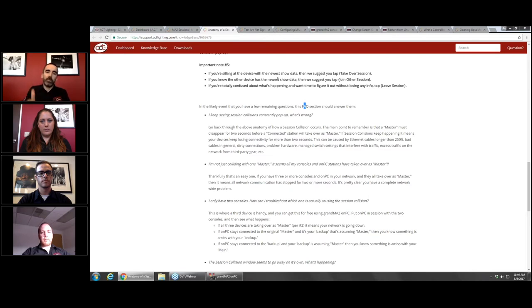You could define what data is going out of which Ethernet port on the MA switch. So if you have a little KiNET power supply, you can plug that into port 8 on the MA switch, for example, and say only output KiNET traffic. The network switch in itself, though, has 16 gigs of throughput, 32 gigs of throughput. I can't remember the exact number, but it can handle all this traffic. It filters it. That's doing its job.